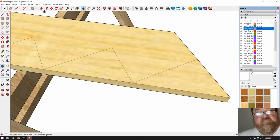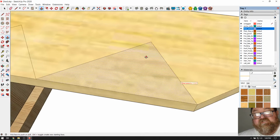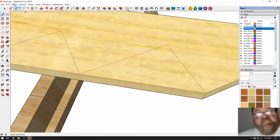Now what you're going to do when you start cutting these cuts right here. This one doesn't matter because you can cut it all the way across, okay? That one cuts all the way across. Don't cut these cuts. Don't come in here with your saw and do this, okay? Don't cut past that little corner. Watch the radius of your saw and just cut right to it, okay? Don't cut past that point.